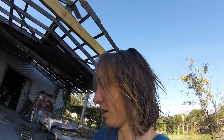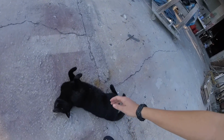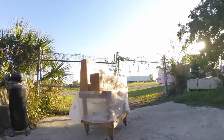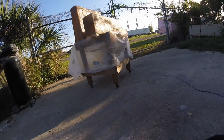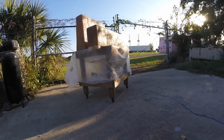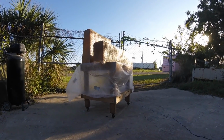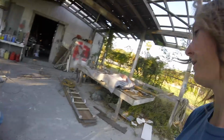Which there's gonna be a special, oh my goodness. It's a special fuel paint that goes in where the fuel is. It's a black paint. And then the water gets a special potable water paint. So there they are. And then once I get all the hatches and all the parts and pieces on the lids, I'll glass those down and the tanks will be ready.